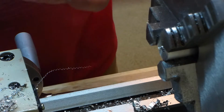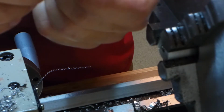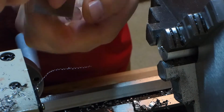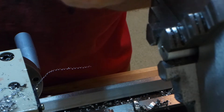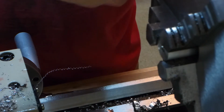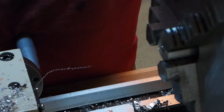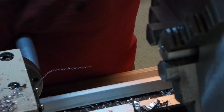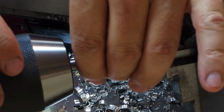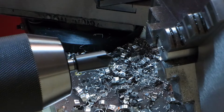The reason I think I might need to countersink the hole is because the smooth part of the shank comes through here and probably will run into these threads here. But I was expecting this. And the threads are a little bit bunged up there anyway, so the countersink might clean that up. So I'll do that next. Alright, let's put the countersink in here. Just like that.